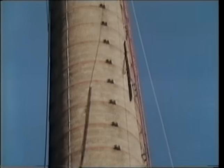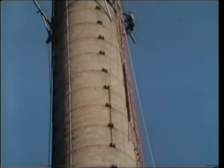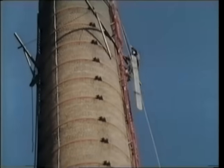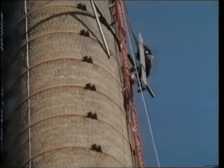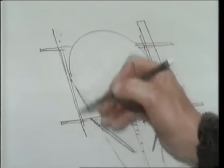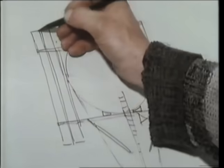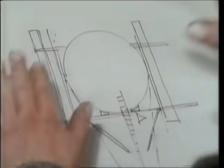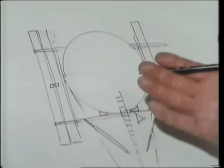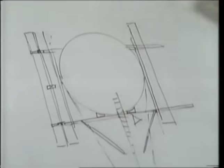After we've got the two batons on and bolted together, the next stage is planks, which form the platform that you walk on. They come up one at a time — some of them 16 or 18 feet long — and when one arrives at the top, it's tied on in a special way so that when I untie it, I can get one plank across there and one across there, and then another one next to it, all the way round the top. You have two iron plates with a bolt through the middle, which makes two boards act as one, and then there's iron hooks that hook them onto the battens, so the wind can blow at 100 miles an hour and they'll still be there in the morning.